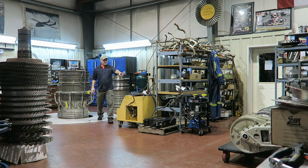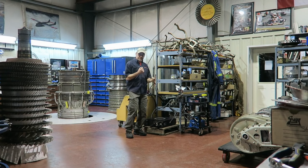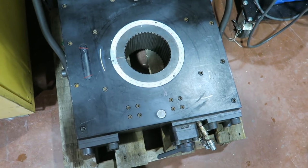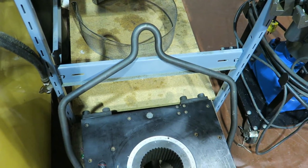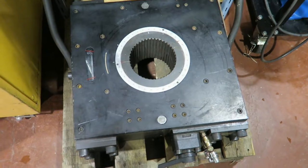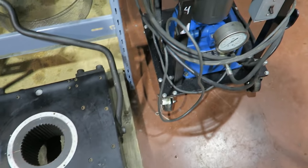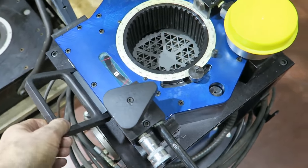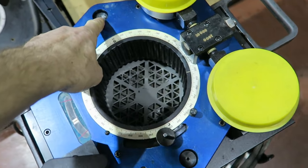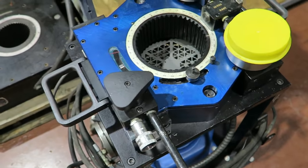We have our two torque wrenches — take a closer look at these in a second. 10,000 foot pounds and 30,000 foot pounds. This is our 30,000 pound torque wrench; it weighs about 300 pounds, so it has a crane loop so we can pick it up and place it. The center spline turns in relation to the body, and the body has pins that stick out on the top or bottom, just like our 10,000 foot pound torque wrench which has handles because it weighs about 75 pounds. There are the two pins right there — they go through the body of the torque wrench and the spline goes all the way through, so you can set it vertically in any position.